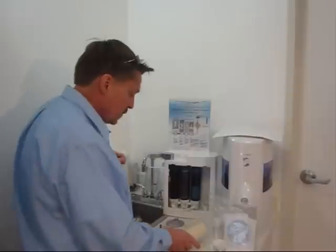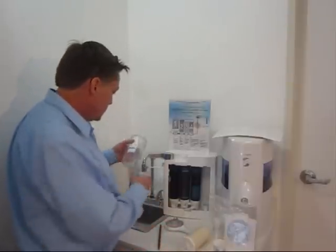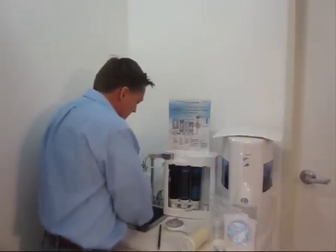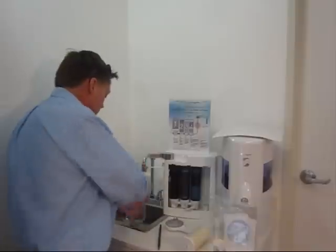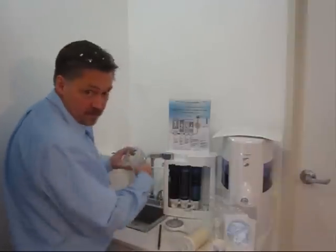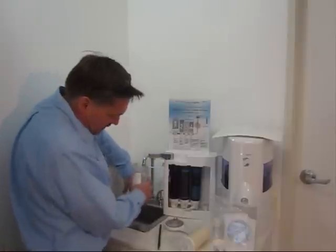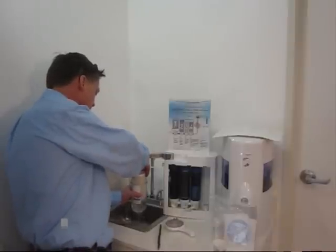One other trick when putting your unit back together: when you put this unit back together, I'm going to rinse this out. It's the first stage of the filter, so it won't make a lot of difference — this is where the dirty tap water starts anyway. What we're going to do is fill this up with some water, maybe half full, and then I'm going to slowly lower the ceramic piece into that over the sink because it's going to overflow.